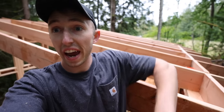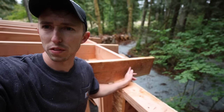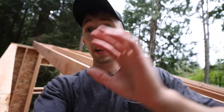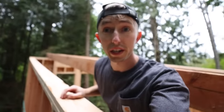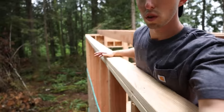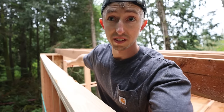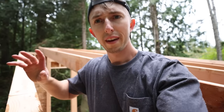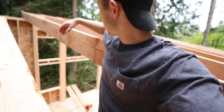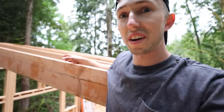Okay so we're up on the roof here and I've set the last truss that's running across. You can see the overhang here — I think this one's like 14 or 15 inches. But the other side that looks out over the feature area has a 24-inch overhang. So what we're going to do is mimic that 24-inch overhang at this end and copy it over here so that people looking from that way — the money shot of the house — will see a consistent roof line going all the way around. We'll have lighting that's overhung going around the perimeter and it'll be really cool. So I'm going to set a bunch of kickers coming off here and they'll hang out 24 inches over, tied right into this guy.